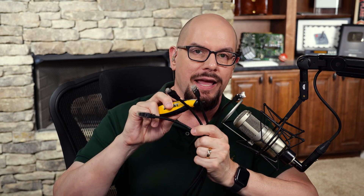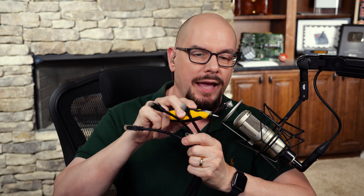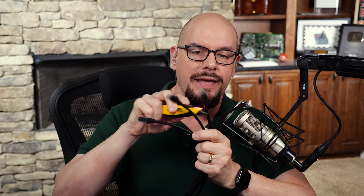In this example, we're just going to go through four wires, but I'm going to show you how fast it is to be able to do this. I have my inductive probe. I'm going to push down on this inductive probe and simply touch it to every cable that I happen to have in this list. And when I get to the right cable, you can see that it turns on with the light, it makes a noise, and I have identified where the end of that cable happens to be on the other side.